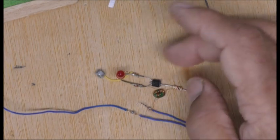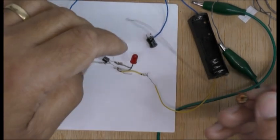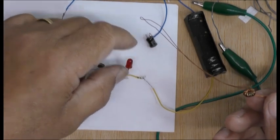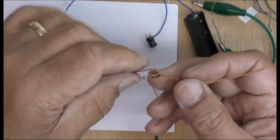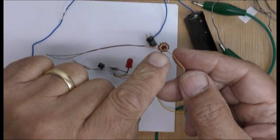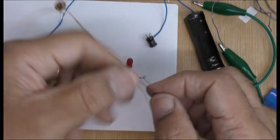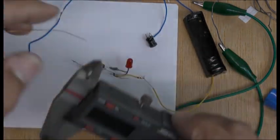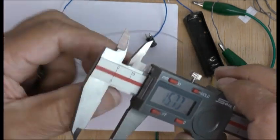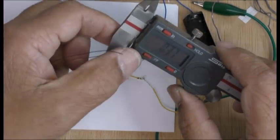I am going to renew it. After trying many capacitors and some resistors and changing them, I still couldn't get this to flash. So I thought maybe the toroid should have more turns on it. I've got 10 turns on because I can't get any more wire through the middle. I'm using a thicker gauge wire this time — maybe that's what it needs, I'm not sure. Someone's going to ask what gauge wire it was — let's check: 0.3536, that's the diameter of the wire.